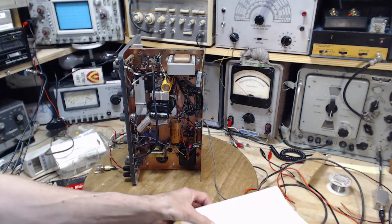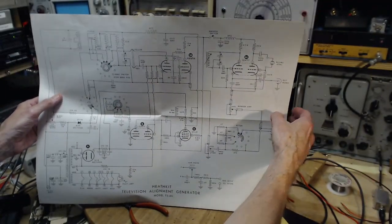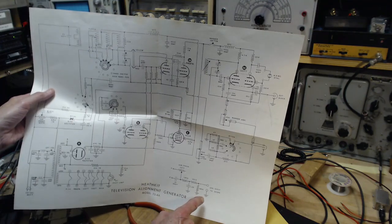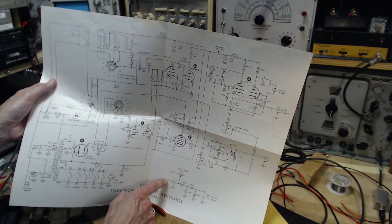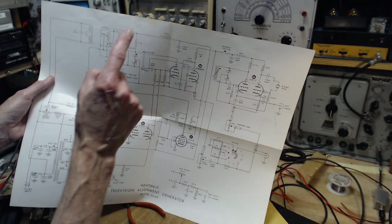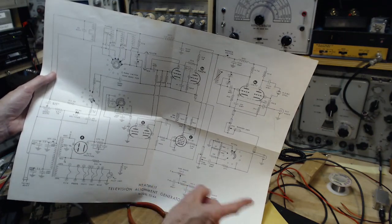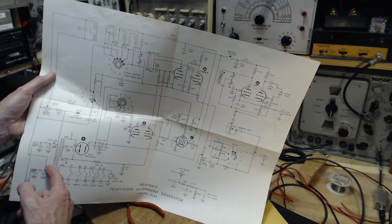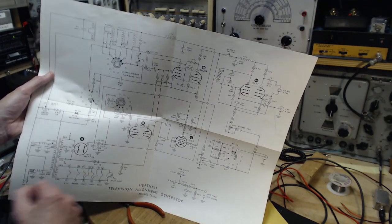Okay, so I've been sitting on my deck reading through the manual again. This is like the fourth time through it, but this time I'm absorbing a lot. I'm over the hump here. Some interesting things. On the schematic is this little circuit. Horizontal input to scope. Here's the circuit that drives the horizontal movement of my scope, and it connects into this at points A and B. I looked high and low for A and B. It turns out they're over here, right on the power supply transformer, because, of course, the horizontal output, or the sweep, is derived directly from the 60 cycle power line. So it's not surprising that it's taking it off here. Okay, that's an interesting little thing.